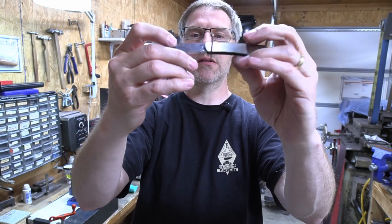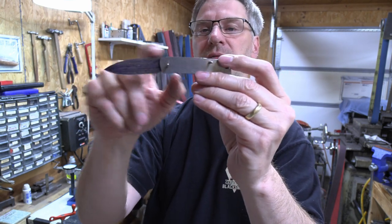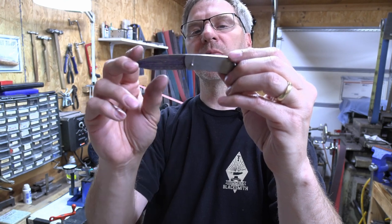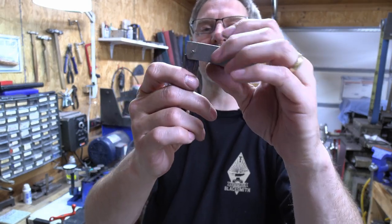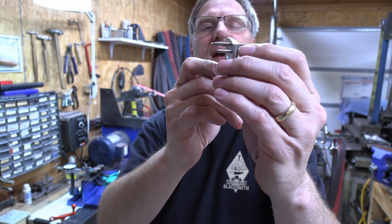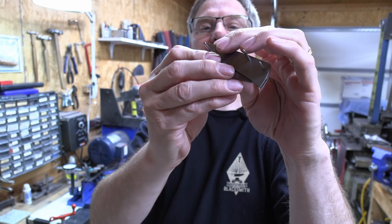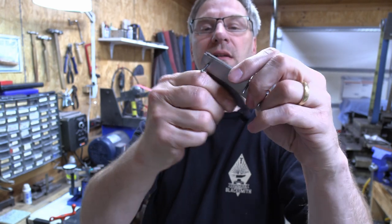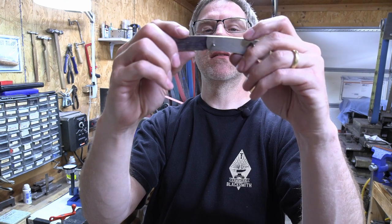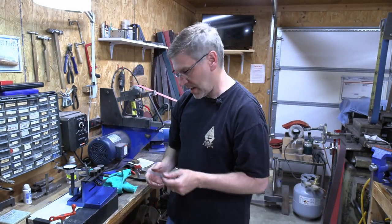The profile is done — you can see it's even across the back. With a little oil the slip joint works pretty good. Let's check and see if we're flush across here. Remember, I left it between six and seven thousandths high before the spring was under load. Now that it's under load, it's almost perfectly flush. When closed, it's sitting just barely proud, which I'd rather have than being low — if it's low I'd have to go back and take more off the spring notch. That's looking pretty good.